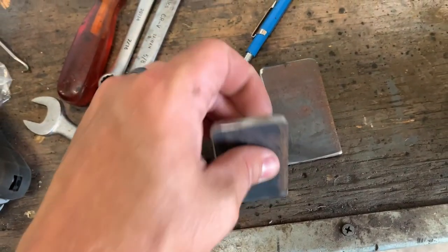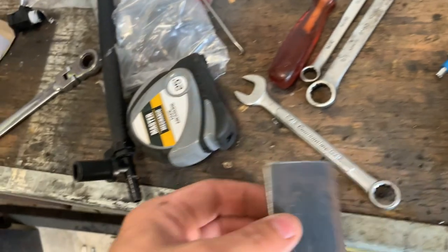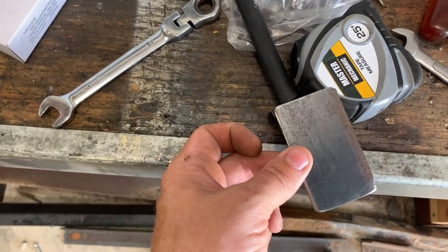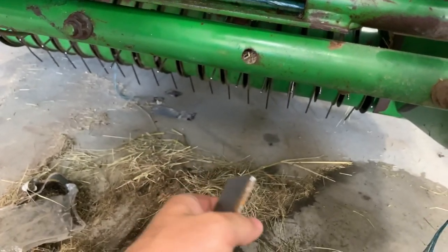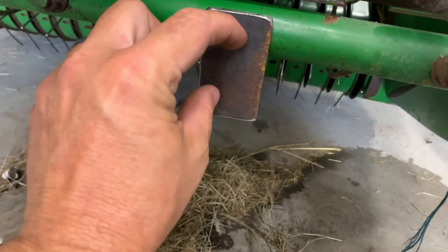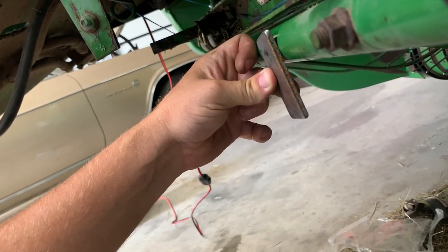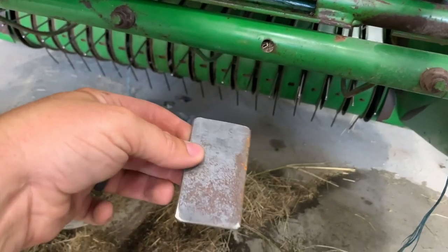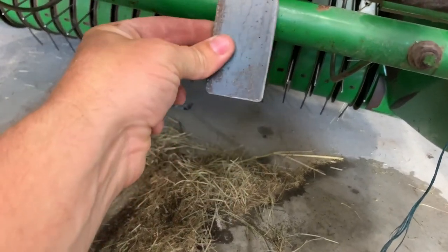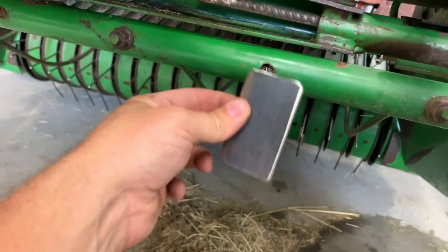Here's the plates — I ended up making them out of eighth-inch strap already cut to length to minimize cutting. I just need to drill a three-quarter-inch hole to put that through and a half-inch hole to mount it. I may have to actually bend this lower part back toward me so it sprays closer toward the hay — otherwise it's going to be spraying straight back. And from what I've read online, this hay preservative is pretty much like an acid and it's corrosive to metal, so I don't want it spraying all over the baler. I want it pointed down so it gets into the hay.